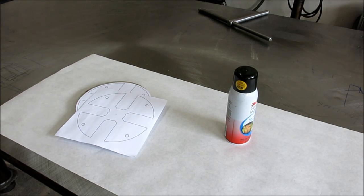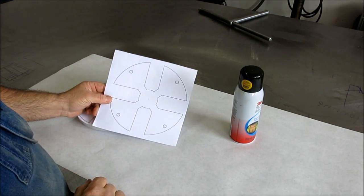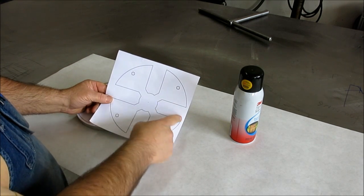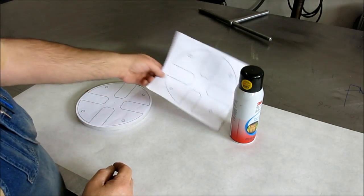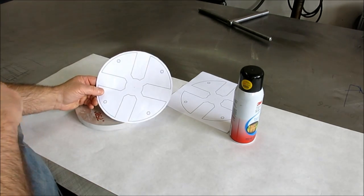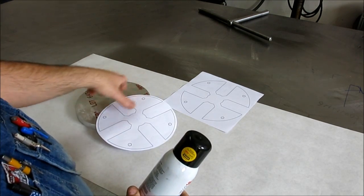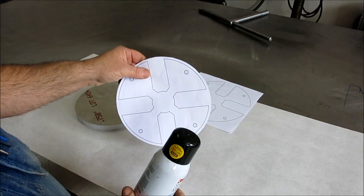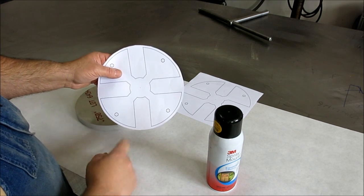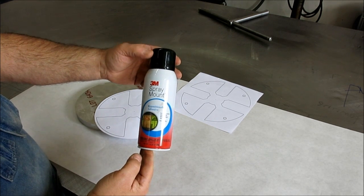Here's what it's going to look like. I drew these on the computer real quick in AutoCAD and printed them out one to one. These are the cutouts for the jaws, and I printed two of them. Here's our blank which is just a circle of aluminum. We're going to bandsaw this out — none of those contours need to be machined profiles. We might turn the OD just for fun so it doesn't run out, but all this business in here can be bandsawed.